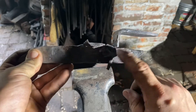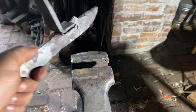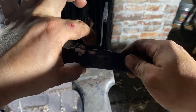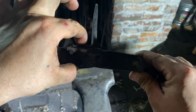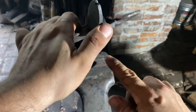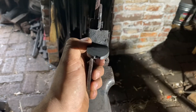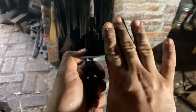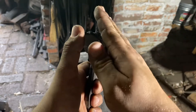This still needs lots of work, but you can see the only light coming through is right here at the pan — the flash hole — and that's exactly what we want. The reason you see light is because there's a little lip of the pan peeking out there. I've got to take that little ball peen and peen this up flush and file it flat with the bottom to help seal up that indentation I made.